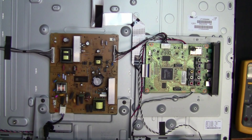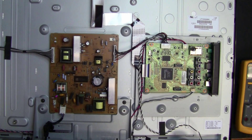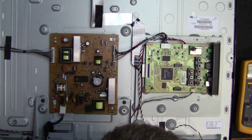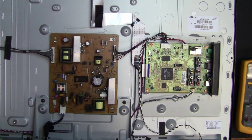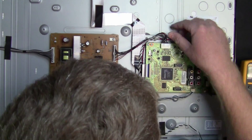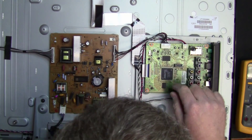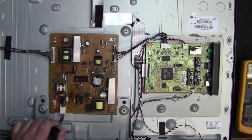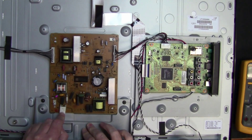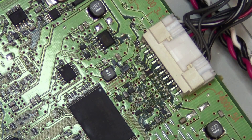Right, that's back in place on the side. One thing I did notice now when I try to power up — the power supply had a bit of a strange sound, which was quite unusual. Anyway, now I'm going to head over to the main board and start doing some diagnosis. There's no labeling or marks or anything on this board, so what I'm going to do is try and look for the voltages, do some homework on this board, maybe flip it over and see if there's anything obvious. First thing — unplug our mains before we start digging around.